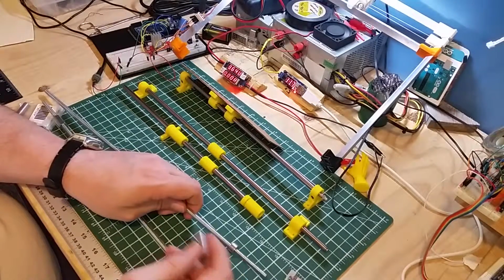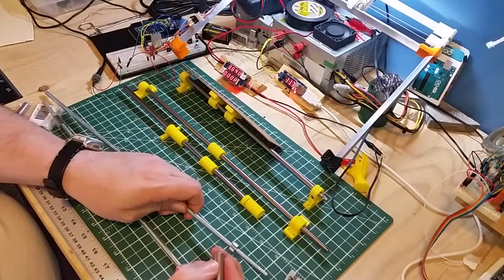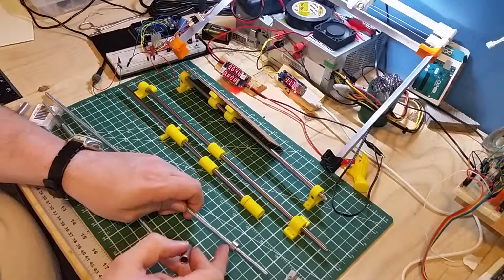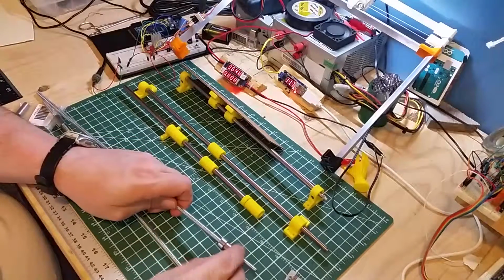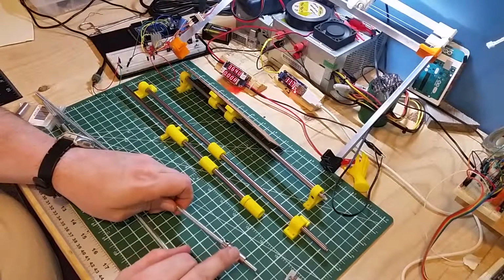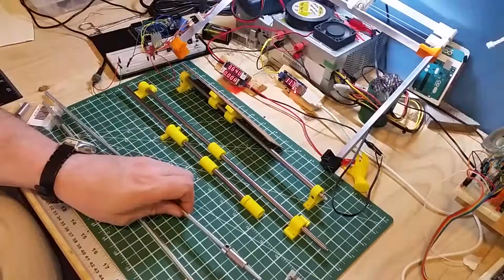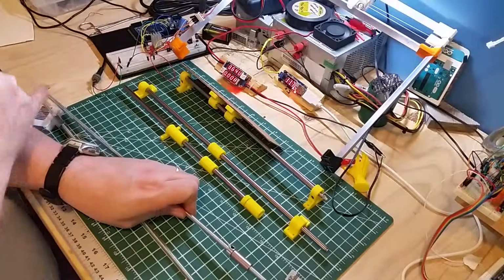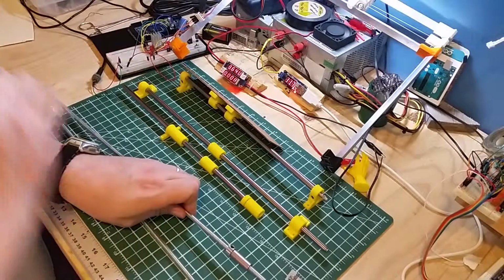the stepper motor. So the weight of anything on the lead screw is going to be resting on the top of this with a washer against that. So essentially you'd have this. In fact, I probably don't even need a washer, except that might not be a smooth enough joint there, but I'll probably put a washer in the middle there. So essentially you'd have this at the bottom. That'll be cut in half, and the other half of this would be at the top.